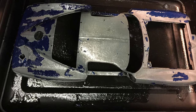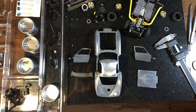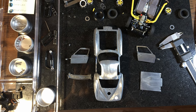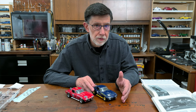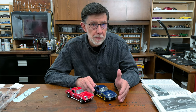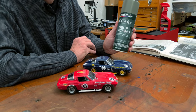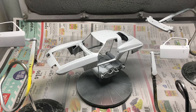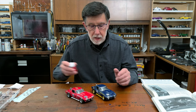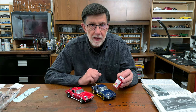So the big step is to put it in the bath. First I tried aircraft stripper — it sat in there, most of it came off, but there were still some really difficult spots. Eventually after dipping three or four times, I got it off. Once the body was clean — and remember it's made out of ZAMAC, which is zinc — you really don't want it to sit out in oxygen and oxidize, so you want to get primer on as soon as possible. With the body cleaned up and dry, I used self-etching primer right out of a spray can to seal the metal. Next it was time to fire up the airbrush with MCW Rally Red, which is a perfect match for that factory color.